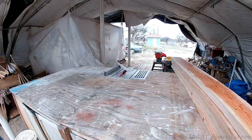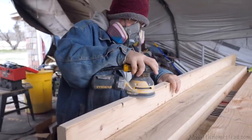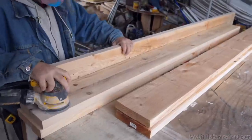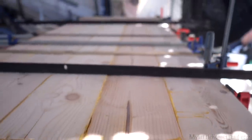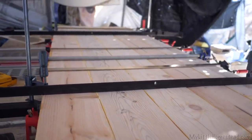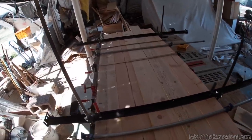I've got the boards cut now for the second door and they're all trimmed down to a flat level, taking that bevel off the edge. Right now I'm going ahead and gluing the pieces together so that we can create the doors. Using these clamps does require an extra little piece this time. I didn't have enough clamps to do a whole bunch across there, but to keep the waviness down I've got a couple of L brackets. We're clamped and we're going to let this set overnight and see what we get tomorrow morning.